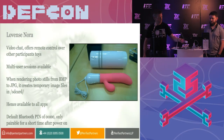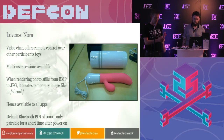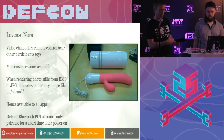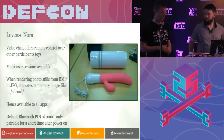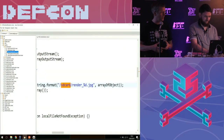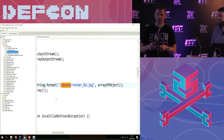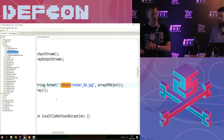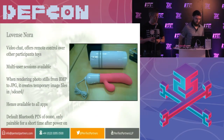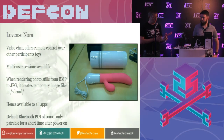I want to start at the very beginning with a story we published a couple of years ago. This is the Lovense Nora. The idea is you have a smart app, it connects to the app over Bluetooth, and then whoever you want to connect to has one of these — you can have a remote control video session and people can control your toy and vice versa. You can actually have group sessions as well. We started having a bit of a poke around. We discovered it can render stills from your video feed, and when it processes from a bitmap to JPEG it creates a temporary image and writes it to /sdcard on Android — a really bad place to put temporary image files. It also has a default Bluetooth pin of four zeros. The good news is it's only in a pairable state for a minute after you power on. You could in theory take remote control of someone's sex toy over Bluetooth, but it's probably a little impractical.